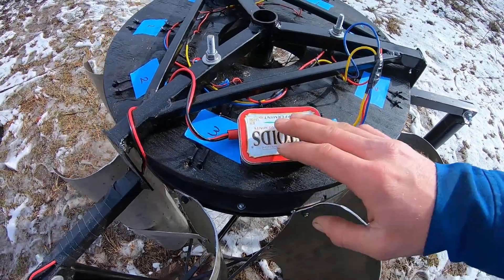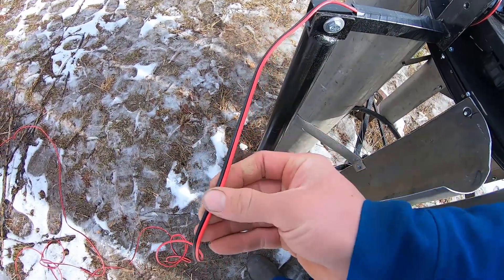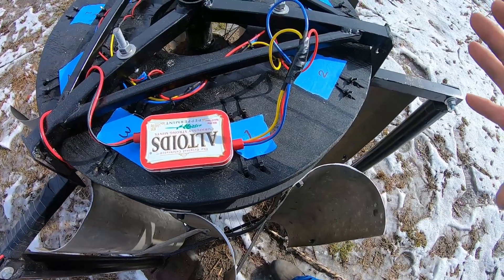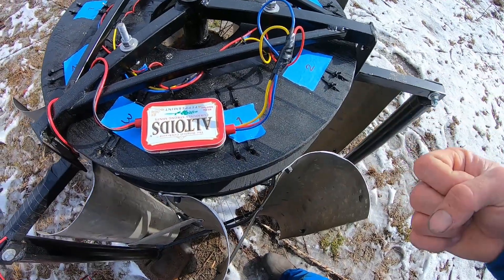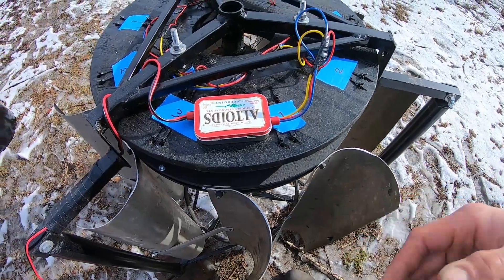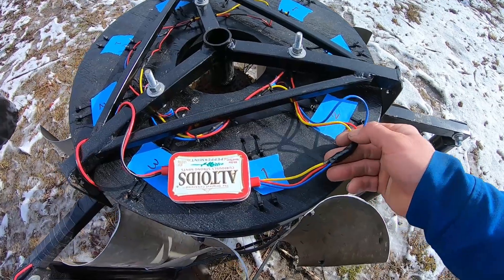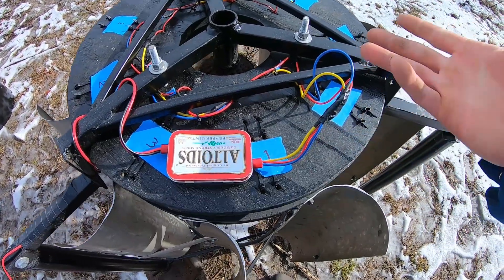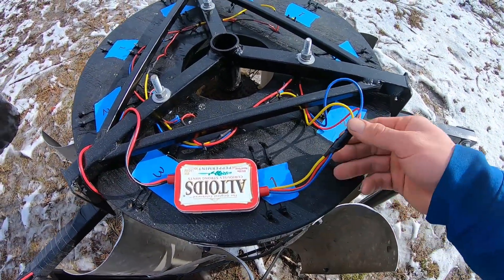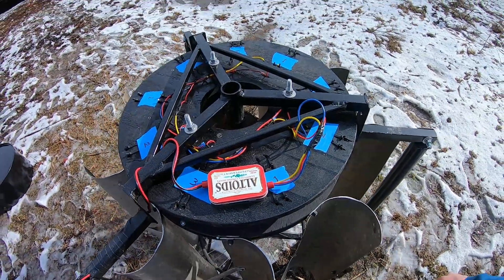We take our two outputs here — this is just a length of 14-gauge bonded wire that I got at the farm store, made for trailer wiring. Most commercial wind turbines that you buy are going to be three-phase AC output. All of my connections are soldered. I did buy wiring for this; it was color-coded. But you could easily repurpose wire from the microwaves — I just chose to use nice wiring for this case because, again, this is going on YouTube and people are vicious, man.